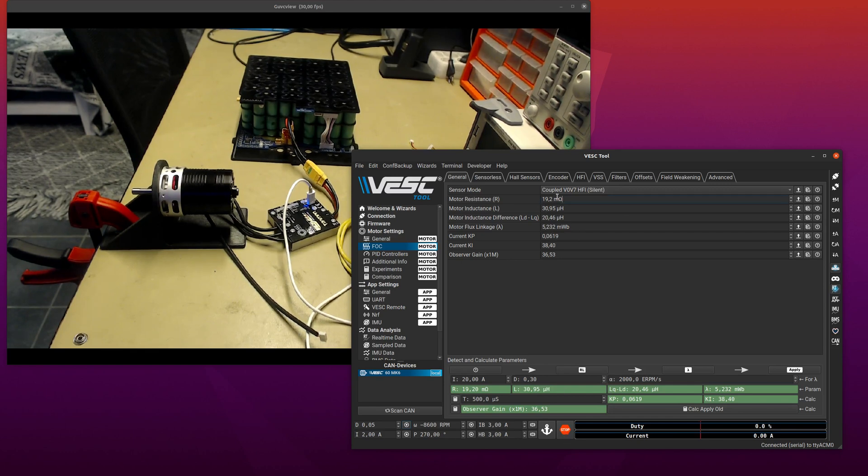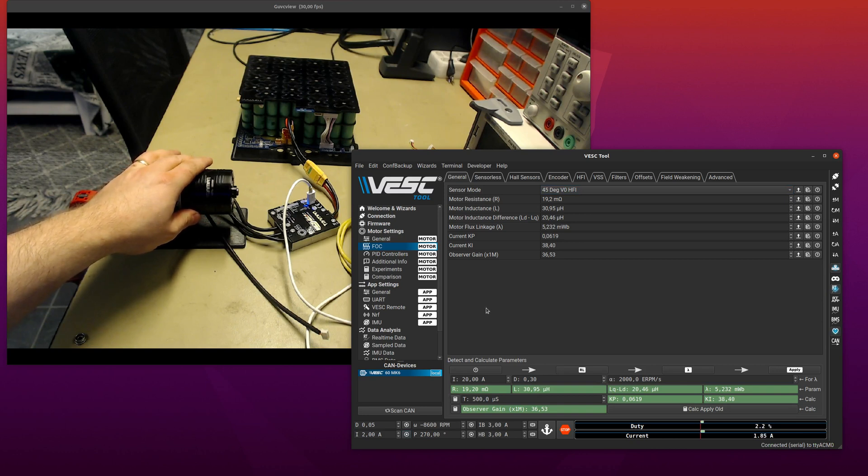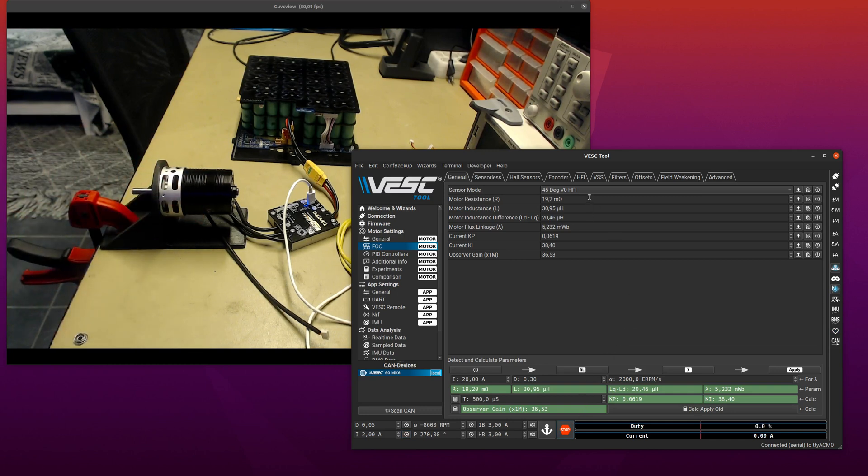I can also mention that the V0 and V7 versions only work if you have phase shunts, because it relies on getting a current measurement in V7 too, and if you don't have that then it can only do the measurements half as often and then they will not be silent anymore — you're going to get 8 kHz noise in this case, which can still be quite annoying. So for this method it's really an advantage to have phase shunts. If you don't have them you can select either of the other two and they will behave the same; with phase shunts this one will do it twice as often so you don't get an audible noise.